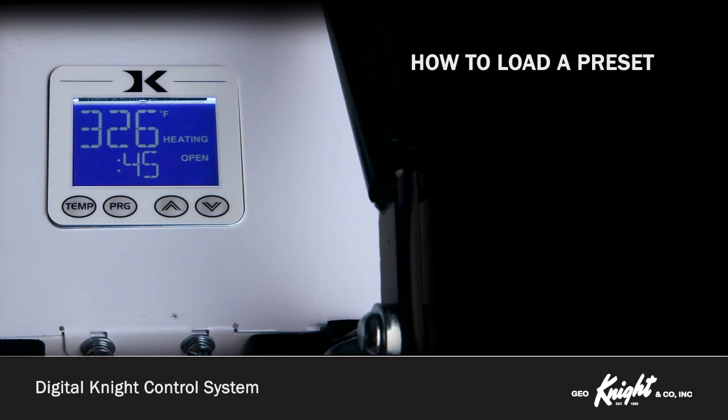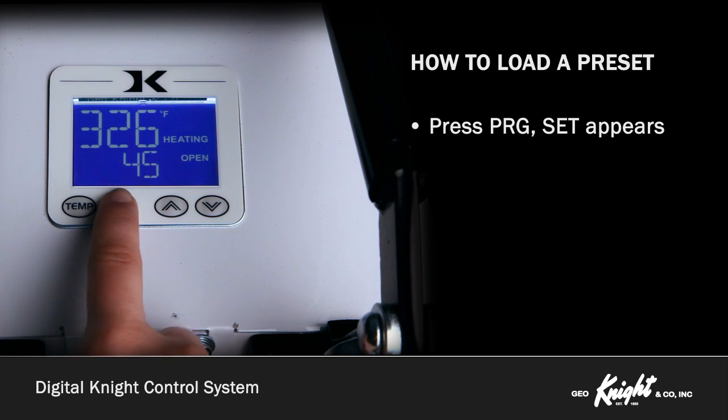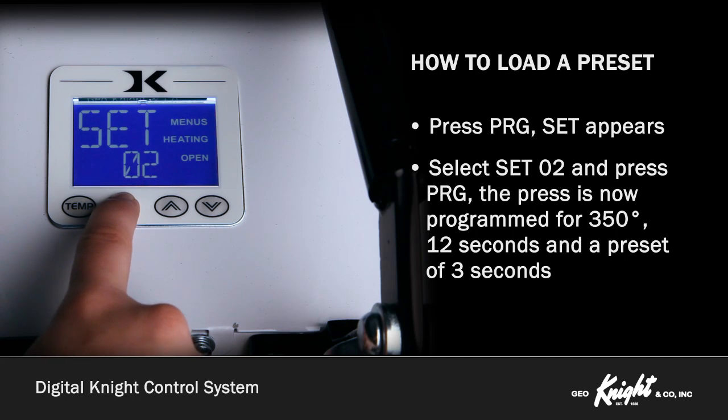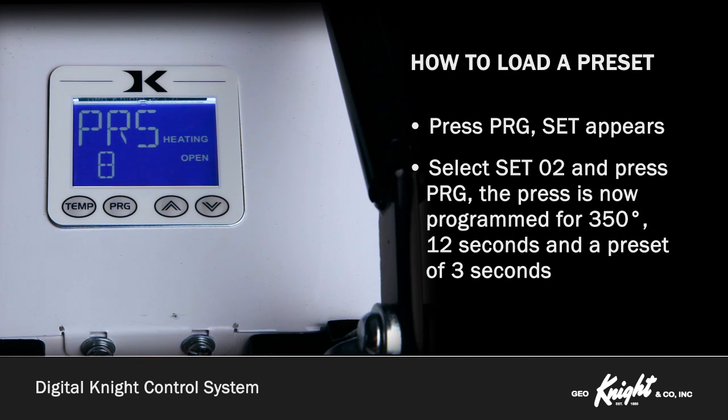Let's say that our first job is complete and we need to load preset 02 for the second job. Press Program. Set appears. Use the arrow keys to select Set 02, then press Program. The press is now set for 350 degrees Fahrenheit and 12 seconds with a 3-second pre-press, and you are reminded to set the pressure heavier, around 8, on the bar graph display when closed.